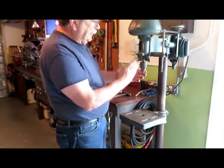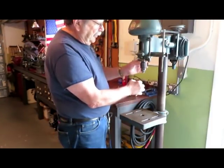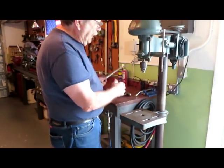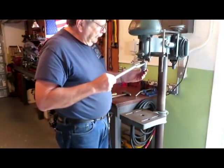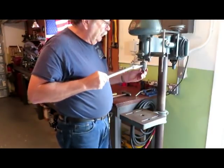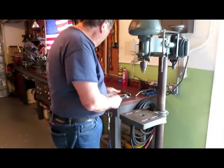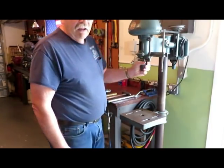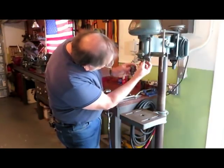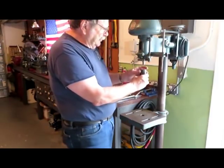They show a complete spindle with chuck, or a complete spindle that has a Morse taper with a chuck on these models. And I didn't have a wedge, so I modified a pickle fork for doing ball joints, which went in, and it wouldn't take it off. But it started pulling the shaft out of the quill. So I called everybody, I emailed everybody, I talked to a lot of people, and nobody knew how this was. And it was deceptive because there's a collar in here that is way bigger than any taper size I could find in the book. So I didn't know what I was up against.